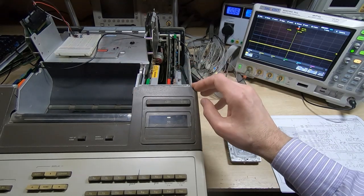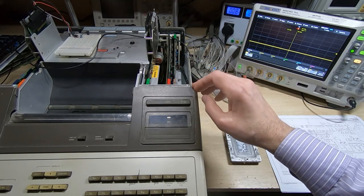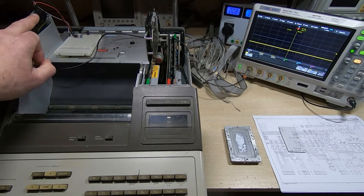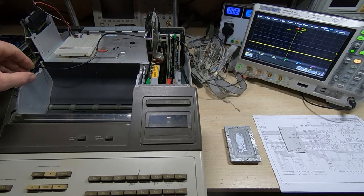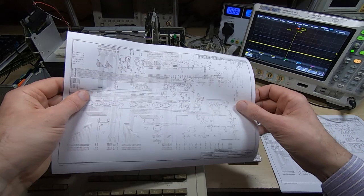At first I suspected my cobbled-together circuit might not be working, so I checked it and the signal was fine — compared it to the actual monitor and it's pretty much identical. I then suspected the interface board, this tall riser board that connects the monitor to the motherboard, and traced the signal through it. It goes through several gates, and the signal should come out as the POC or not-POC signal. It was making it through and appearing on the motherboard correctly, with the CRT line low to enable it — everything was working.